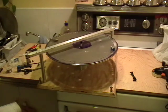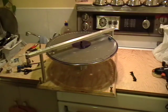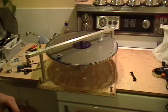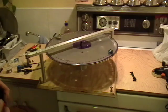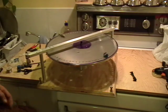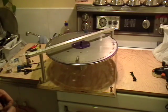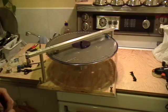I really didn't think it would make that much difference, because magnetism is a conservative force. But clearly, the presence of the stator magnet is not helping — it's hurting. It's causing drag. The system is dissipating energy when the stator magnet is in place. People who are building magnet motors should really do a test like this when they think their magnet motors are running, because they might not be.